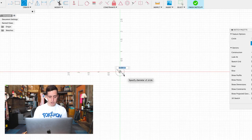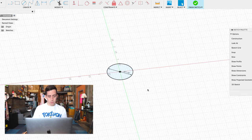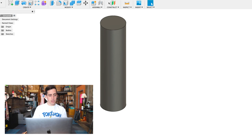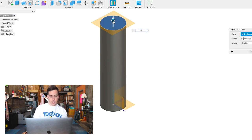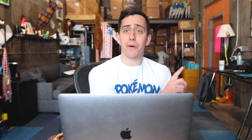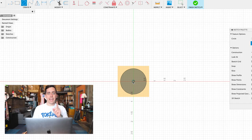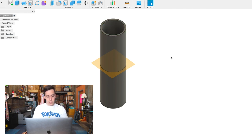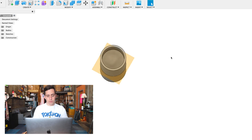We're going to have a 1.3-inch circle that is going to be 5 inches high. We're going to create a construction plane and go down 2.5 inches so we can divide this exactly in half. I learned all of this completely on my own using YouTube, so if you're a professional judging me right now — I don't know what I'm doing. To fit the dowels in, we need a circle that is 1.13 inches and we're going to go down 1.2 inches into there. Within this hole is where the dowel is going to stick in, and then we need one for the other side.